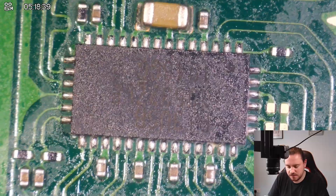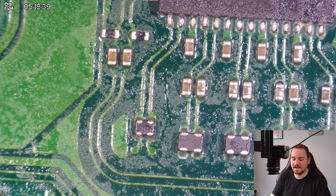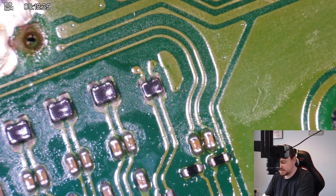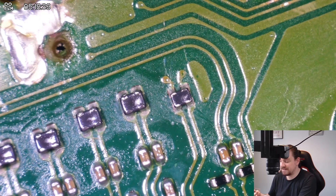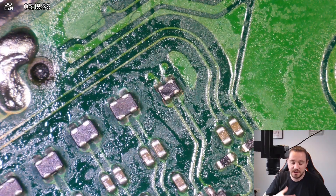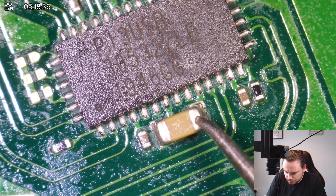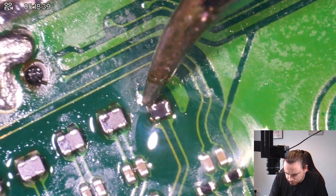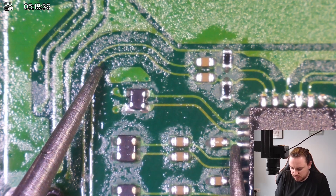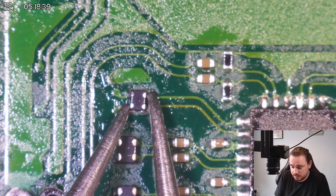Luckily I have a replacement P13 chip — that's no problem. For the filter, I'm going to have to use an old donor switch that is completely ruined. I took apart two switches and found one that had exactly what we needed. In continuity mode I'll test the donor filter before pulling it — it seems to be fine, definitely fine. So we know we have a good filter. We're going to take this one off and then test to see if the shorts are still there or gone on the P13 chip.